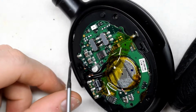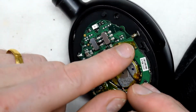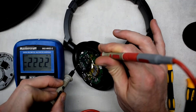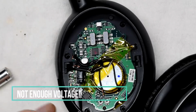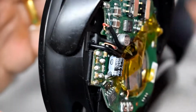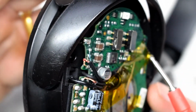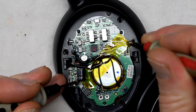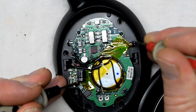Here, this connects to the power, so we'll see if we're gonna get 1 volt here. One way to determine which side is negative: if you look at this capacitor, it has the negative side marked on it, so you can do a continuity test from this leg to the power point and see which one has a connection. So I did that with this one here and this one here, and therefore this one right here is the negative.